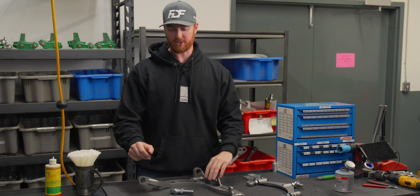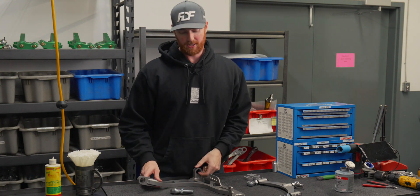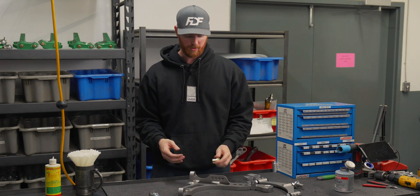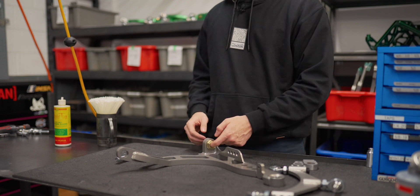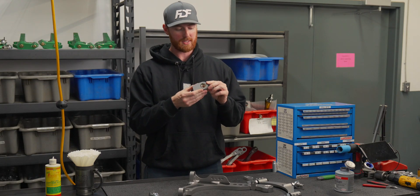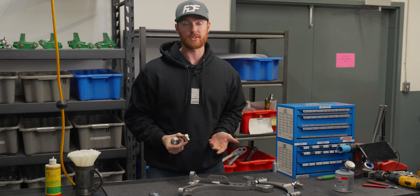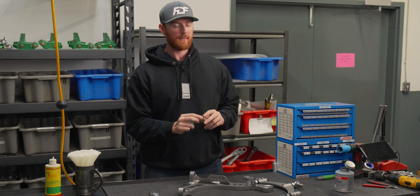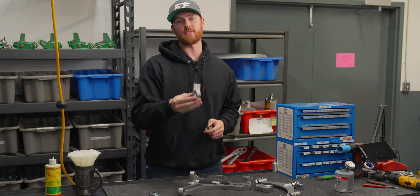We have come up with what I showed you at the beginning of the video, and that is a smooth adjuster. You can see how this adjuster is installed into each piece. The important thing to note is that the shoulder of this adjuster — in Imperial terms — is 700 thou tall, meaning this piece of material that I'm holding is 750 thou, three quarters of an inch. We order material in Imperial, which is why we're talking in Imperial.